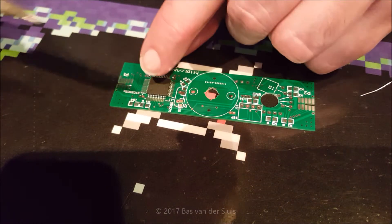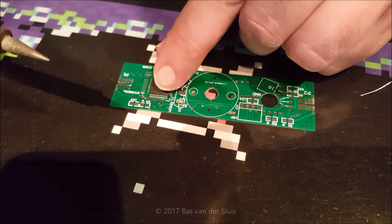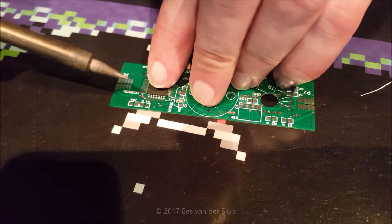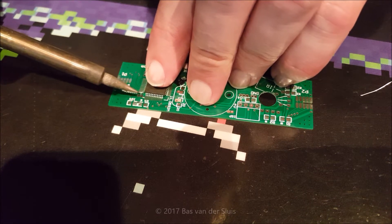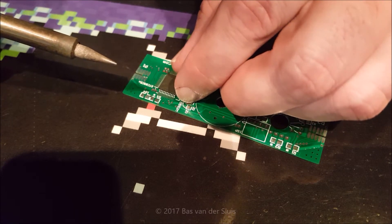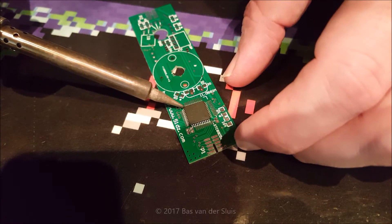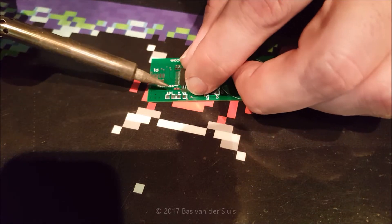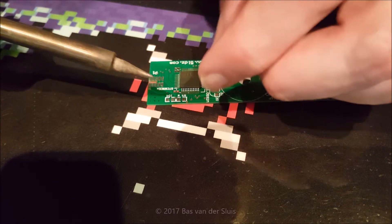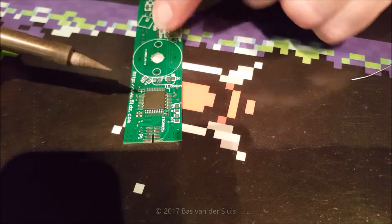So let's see if I can get the IC in position. I do not have a lot of flexibility — the pins barely touch the pads on the board. Now I'm moving it... let's hit it like that. It is soldered, but now it's loose again. So let's give that another go. On there please. That looks better. Actually, all the pins look pretty good aligned to me.